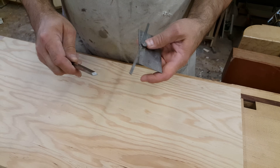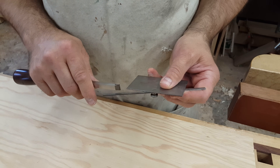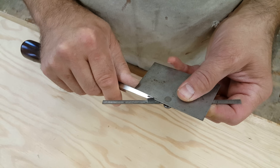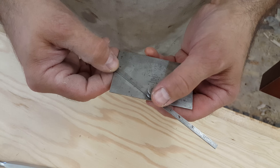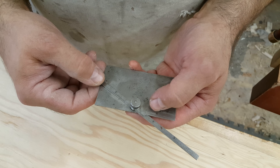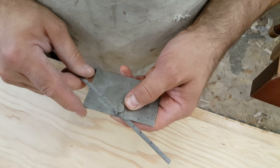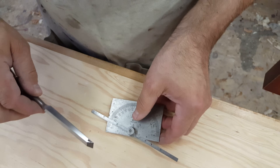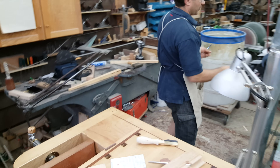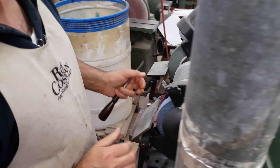The first thing I want to do is find out what the angle of this is. My guess is that's higher than 25 degrees. We are at 29, and I want to get down to 17. So I'm going to go over to the bench grinder. All I know is that I've got to take the heel off of this bevel, so I'll set that up.